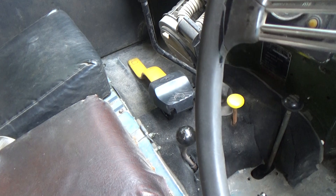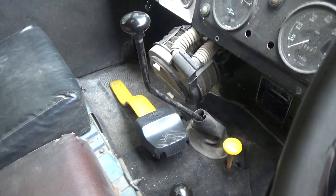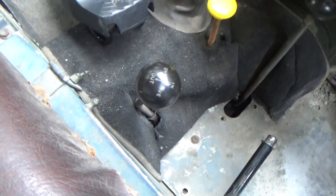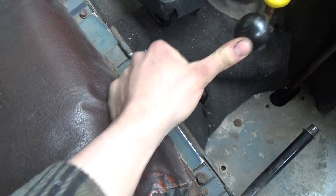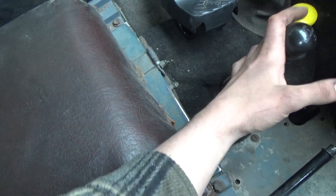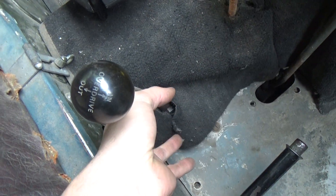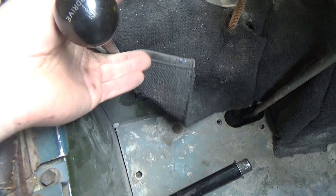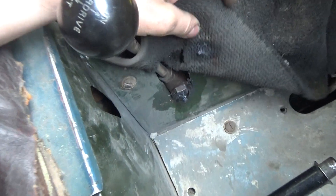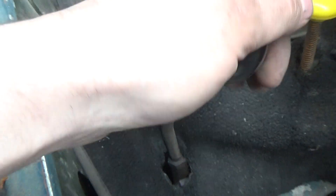So I'm going to show you inside my other Land Rover, because I've already done the thing. Basically, where the overdrive gear lever is — which is this one here — it runs on a pivot. What happens is you get corrosion build-up on that shaft, and it makes it very difficult to change gear. To overcome this, if I lift the mass out of the way, you can see that we've drilled and tapped a hole that we can then put a grease nipple into, and then obviously grease the shaft, which makes it very easy to change gear.